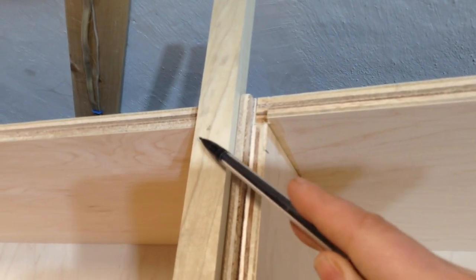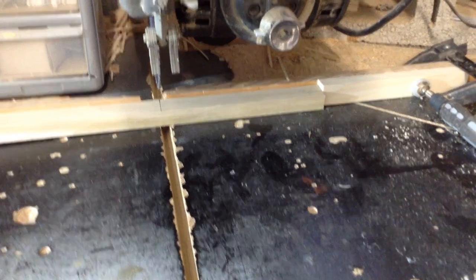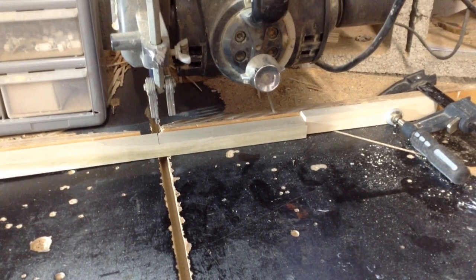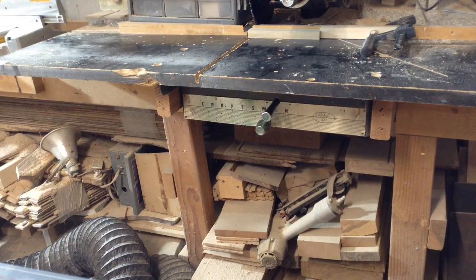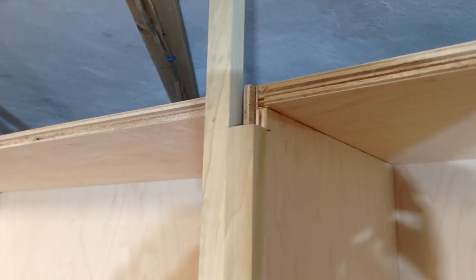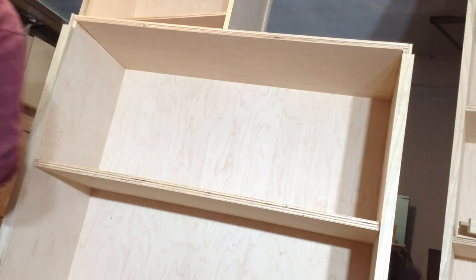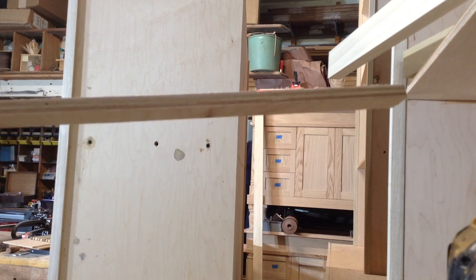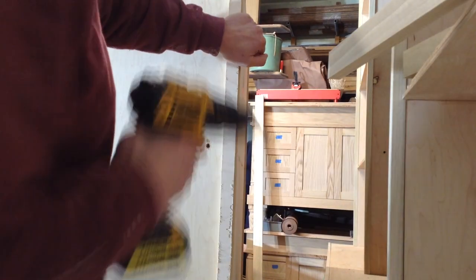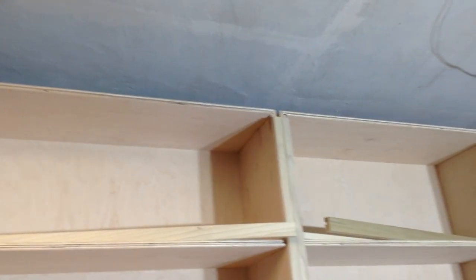In order to attach this, I still have this lip at the top side of the cabinet — I wanted to utilize that for the top, and the whole thing comes down about an inch just for a little bit of added strength. So I could finally cut my stiles down to size. I usually leave them long, but I knew I wanted to leave them extra long in this circumstance because I hadn't decided exactly how tall they were going to be. You can see I'm cutting them down to that mark, and then this plywood facade is going to sit right on top of that. I had to remove these little fins so that the piece I'm putting up top can float across the entire top without hitting those perpendicular parts. And just like the bottom cabinets, while I had these on the floor, I added the little half-inch spacer on one back side so that these two meet at the face frame in the top, but also meet at the spacer on the back — giving a nice solid construction that can't really bow and tweak in the space.